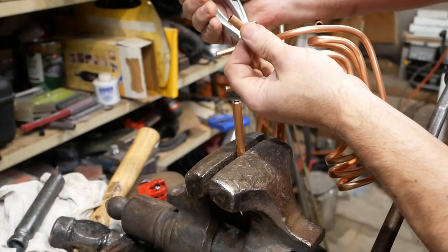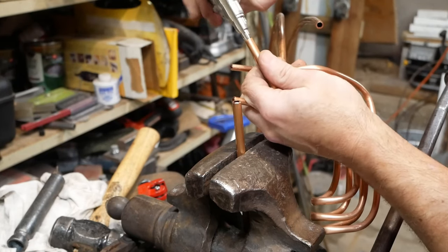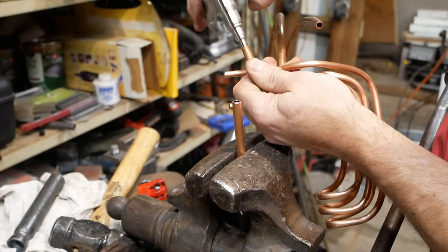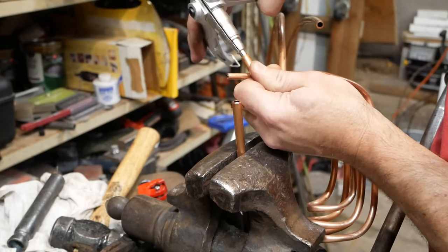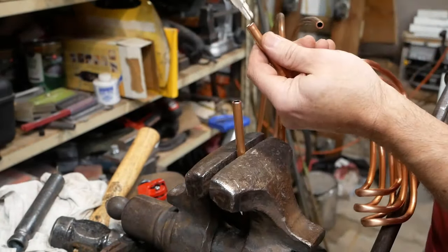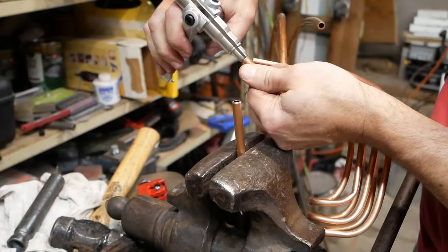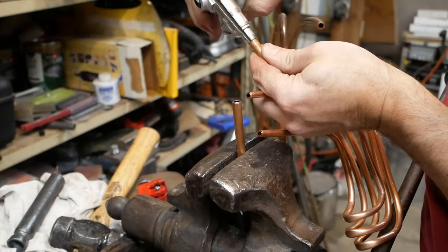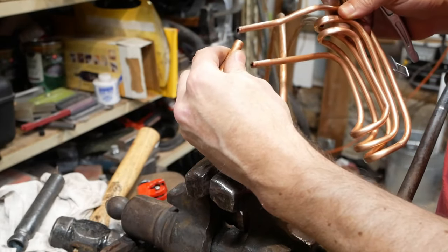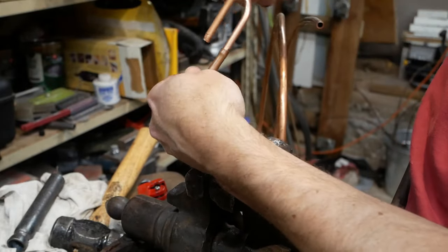I've been making this out of quarter-inch tubing because that's much cheaper for me to get, but I have 8mm stubs which won't quite go around the quarter-inch tubing, so I have purchased a tubing expander, and this is the first time I'm actually using it because this is when I finally ran out of my 6mm tubing. This works quite well. I'm really pleased with it, but one of these I stretched just a little bit too much. I forget if it was the first or second one that I did, but you'll see that when I go to solder that one, I won't show you the other one because that goes really cleanly, you'll see that I fumble with it. And that's just kind of a warning not to overstretch.